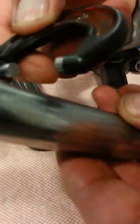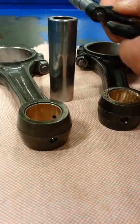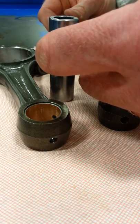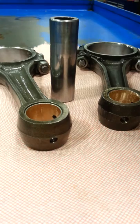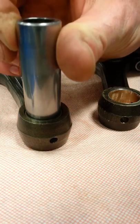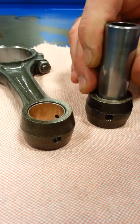Now I'm just going to take the pin. The pin should be just slightly smaller than the actual bore, and I can walk that pin across this and it's snug. If I do the measurement on this... I'm right on 815 and I can pull that off. So if I was to go get an outside micrometer that reads into 10,000ths of an inch, I obviously must have at least half a thou of clearance to allow that pin to slide in there. Right now I've got the exact same measurement for both of these small-end connecting rods.